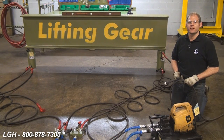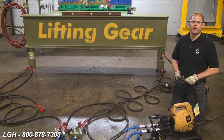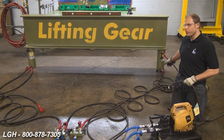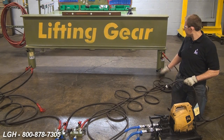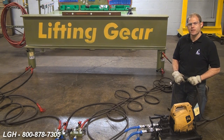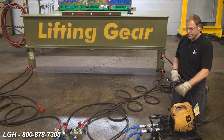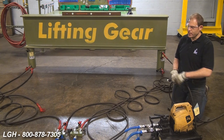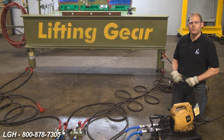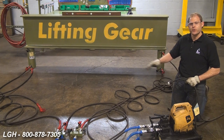The last type of cylinder we'd like to demonstrate are our double acting cylinders, meaning there are two ports for operation. The lower port advances the cylinder while the upper port retracts the cylinder. The entire operational system is different from single acting counterparts — the pump is different, the number of hoses are different, as well as the number of manifolds. There's a manifold for advancing the cylinders and a separate manifold to retract the cylinders.